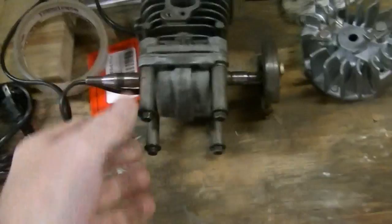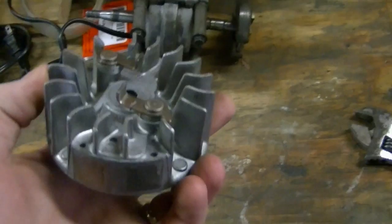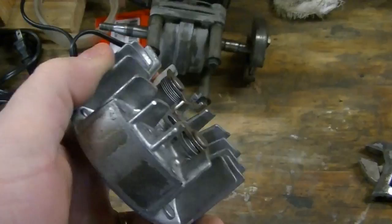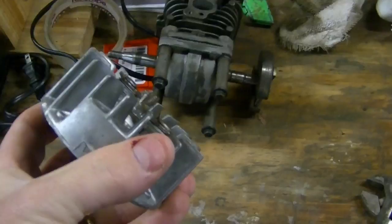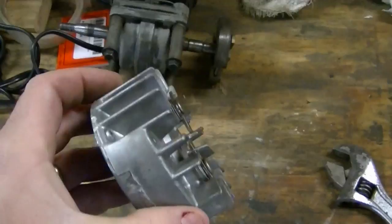As you can see, the flywheel is a fairly light flywheel, but when you put a propeller on it slows down, obviously. You've got all these cooling fins that you don't need. We're going to lighten the flywheel to get a little more RPM and power out of the engine, because we don't need these cooling fins — we have a big propeller that will be doing the cooling.